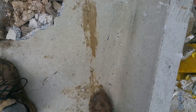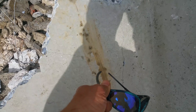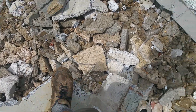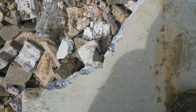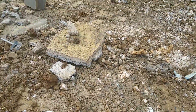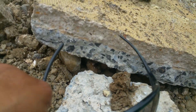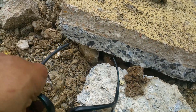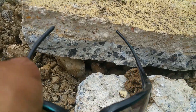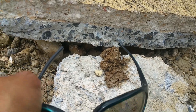Look, this thing is dissected — fully cracked. All right guys, check this out. Here's the crack. It's fully cracked. There's a little bit of wire in there — this should break free except the wire is saving it. Let's put some load on it — that's me with the load on it, here's my leg. That wire is protecting that from falling out with the tension in it. Now look over here — you see the wear layer. This is what I was talking about. You see the two layers: there's the base for the concrete beam and here's the wear layer, which is a different concrete mix up top than the aggregate at the bottom.